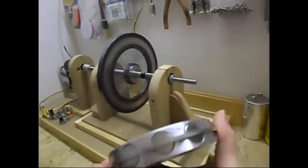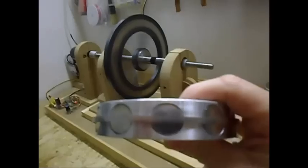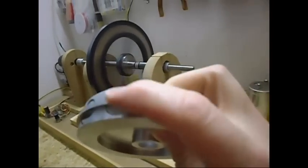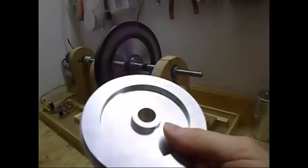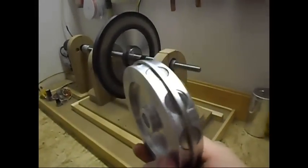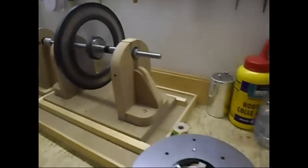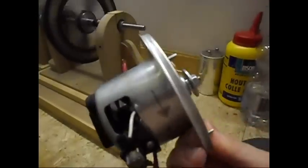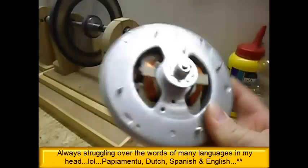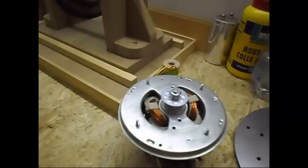I also did a little adjustment on one of these rotors — you have seen this before in the high RPM spool motor of mine. But now I have a ring on it. This ring is stainless steel; it is to make certain the magnets stay in place, because I am going to drive this rotor anywhere between 6000 to 12000 RPM. I am going to use this vacuum cleaner universal motor over here for that purpose. I have been trying to use it for a pretty long time now, but running into all kinds of issues.